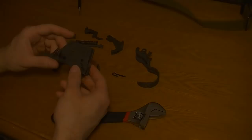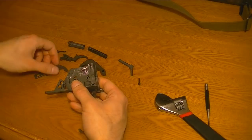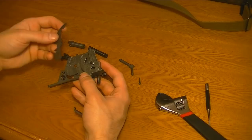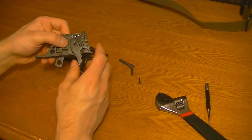Take this and just the exact opposite of how you took it apart — kind of put that in there and rock that in sideways. And the safety: make sure the spring goes in like that, goes on that little pin on the bottom there. And the safety itself. This starts to get a little tricky — you have to compress that spring in order to get the safety in. There's the safety pin, just push it down, on into place. And there's that. Works.